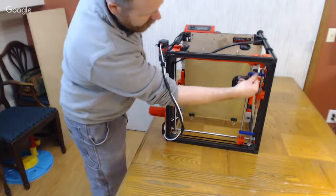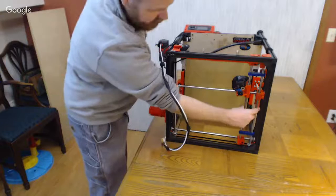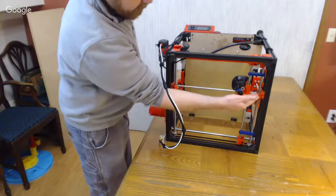so long as they're printed accurately, because it's really tough on two shafts that are on two different centers to get an accurate measurement of that distance. These things are good for making sure that your cross rod here is parallel to the side rod. And then you do that all the way around. So long as your frame was square to begin with, now you know that all of those rods are true to each other.